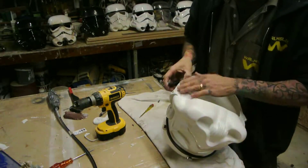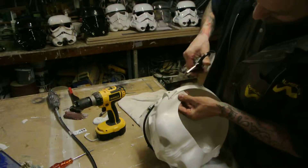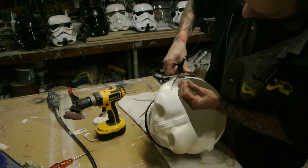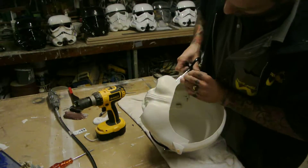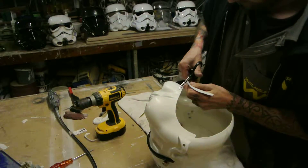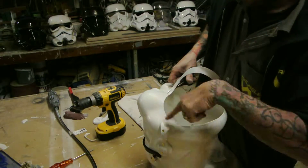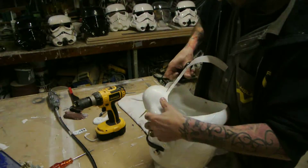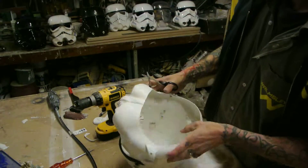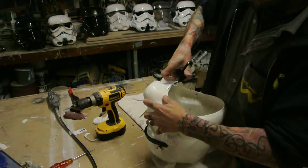It got cut short in the TX video, so we want to continue this flow around from there - give about 10mm to the ear, keep that coming around, then straight off at the front. Don't lose your bulges too much here, but you don't want to leave it too short for the neck hole. As always, you have to put these lids on sideways because of the shape. Bring that back in to the back cap, make sure it looks pretty even, then just keep trimming with a little bit of adjustment.